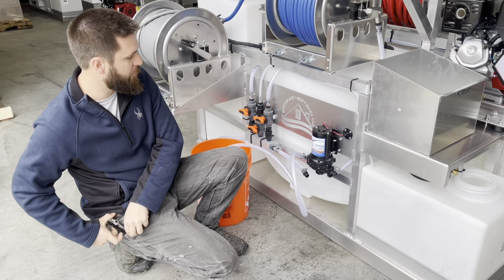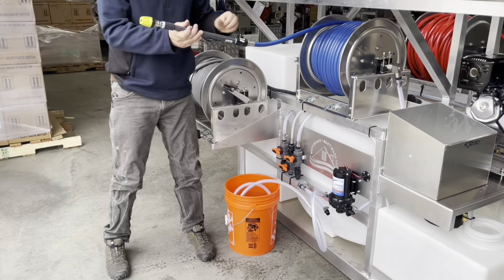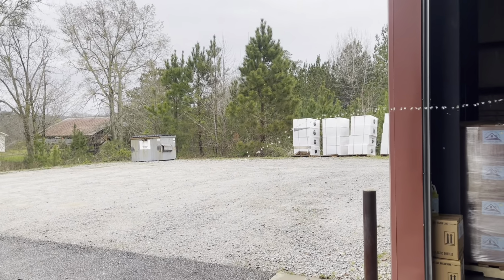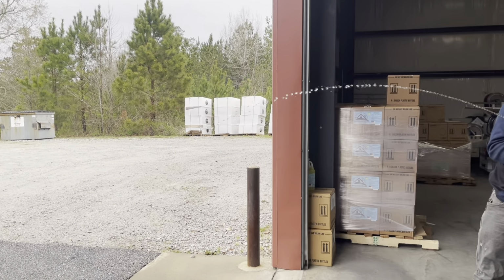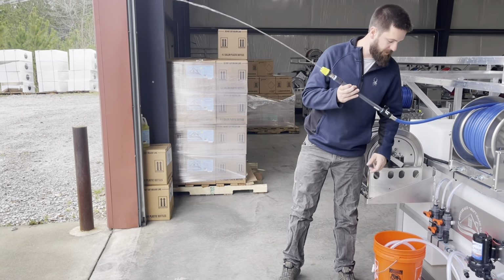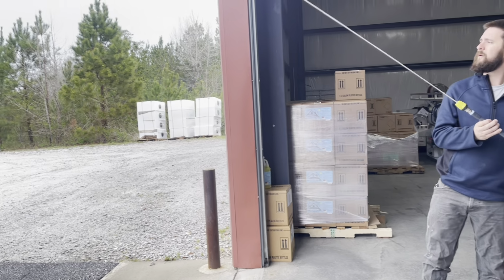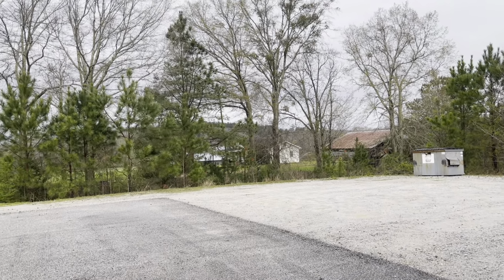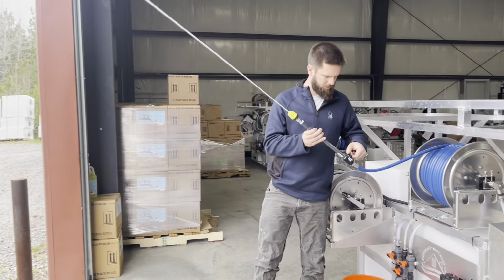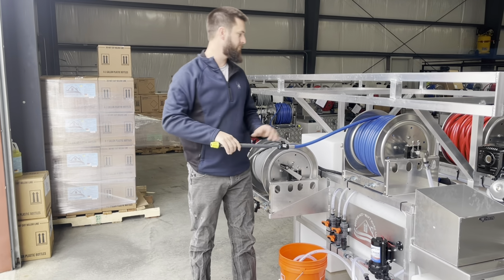And we won't, because I know what the problem is, but this is a good way that you can quickly isolate the issue. Now we're going to have an initial drop in pressure because it's priming back up. I can see it pulling all the air bubbles out of the line. It's a short hose, so it doesn't take very long. Oh, look at there. Okay, we are right back to spraying our 45-ish feet or whatever it is, you know.